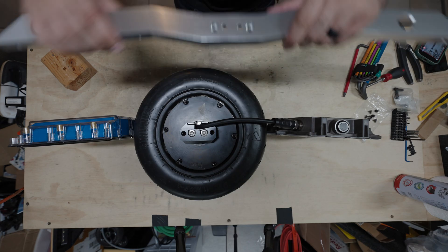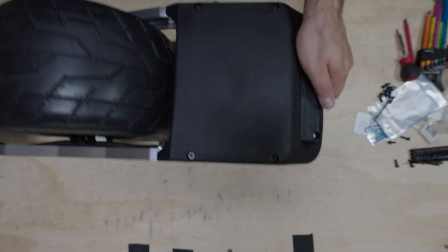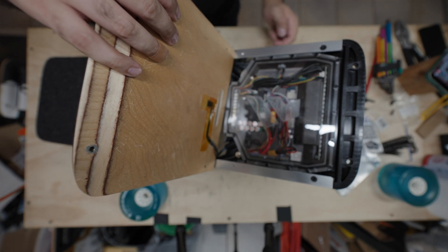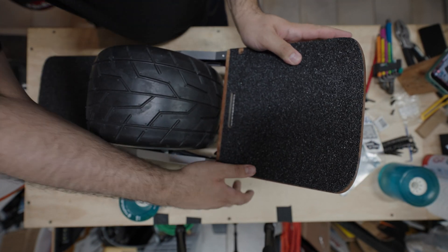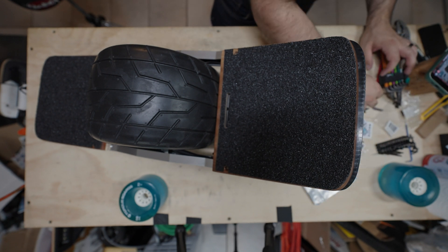That whole core layout was assembled and then installed into the WTF rails, and the board was completed with the rest of the bits. The front sensor pad is a custom piece made from a routed-out Pro Fusion pad to match the rear, installed with a stock V3 sensor. That still works great, and I built this board in July 2024.